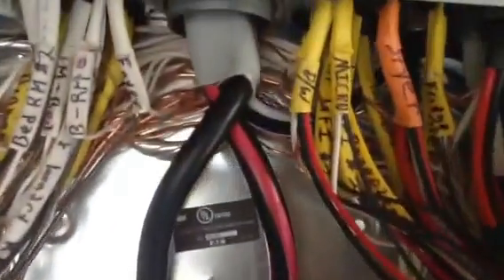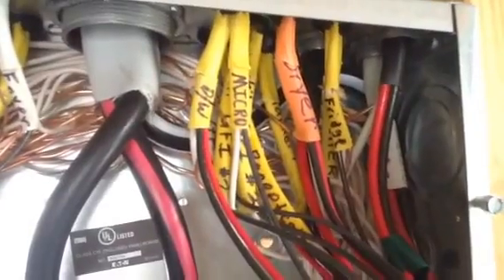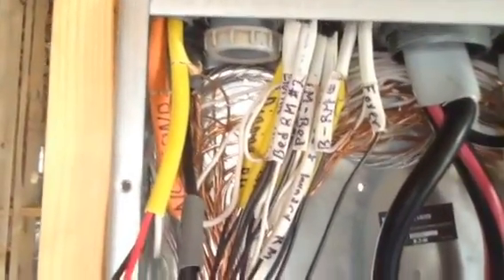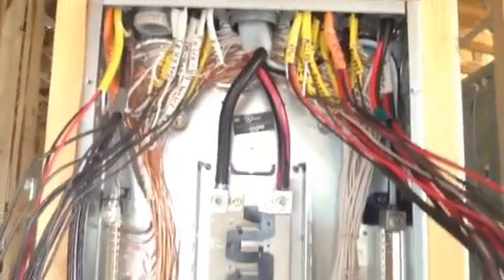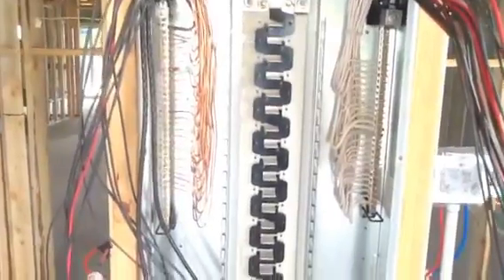One thing that's very important — look at the wires and see how we've labeled them. You see the one marked dryer, the one marked refrigerator or fridge, microwave, dishwasher, GFI, master bedroom. The orange wires are the air conditioning. The reason for that is when you're actually making up your panel box and putting your breakers in, you can label your panel schedule correctly, because it's part of the National Electric Code that you have a legible and correct panel schedule.